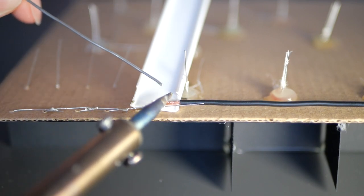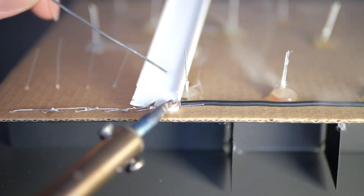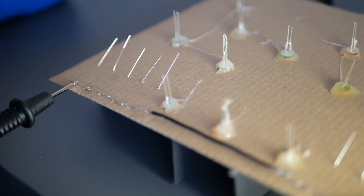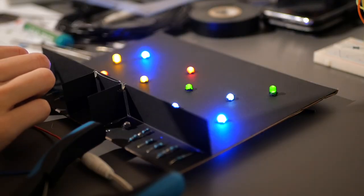This was actually my first mistake. Don't connect them all to the same ground as I did. When I later tested this, the ball lights and strike lights didn't want to light up properly, since they required their own ground, probably because of the voltage difference. I tested the 12-volt part and it all worked.